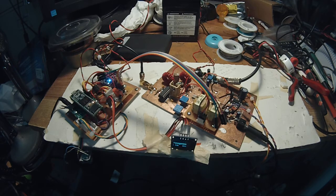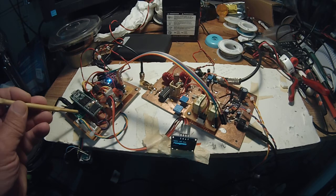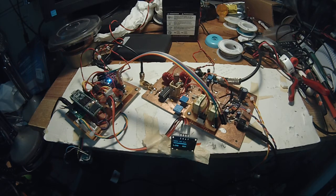So a couple of changes were made. First, the codec board over here was bad, and we fixed that. We put isolated power supplies in this, and that seemed to help, but not totally. Then we added an audio isolator on the output, which was a recommendation from PJRC. They say the audio circuit sometimes has to have a separate ground from the rest of the circuitry ground. I guess that's inherent in the design, but the isolator did cure some of this.